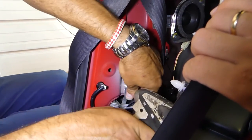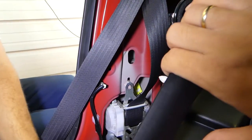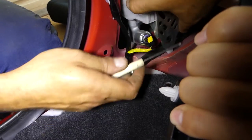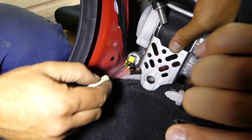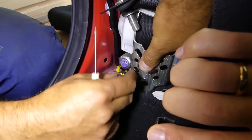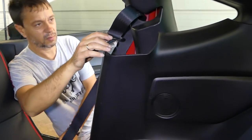And that 10mm — remove that now. Perfect. Now let us show you how we remove the wires. You have to be very careful with the airbag wires; if you don't do it right you'll mess it up. Get a small screwdriver — let me turn the light on so you can see. Lift that yellow tab straight up, place the screwdriver in the designated spot, and pull them straight up. Never twist left or right or you'll damage the pins inside. Then just feed the belt through the hole.